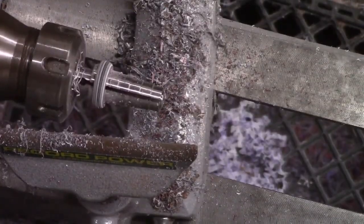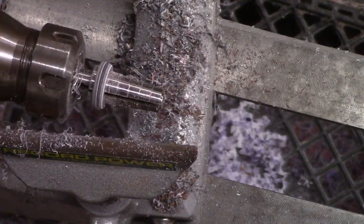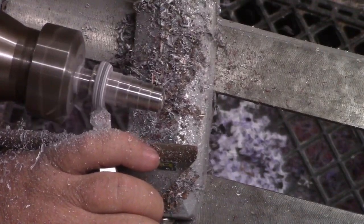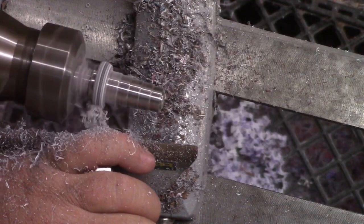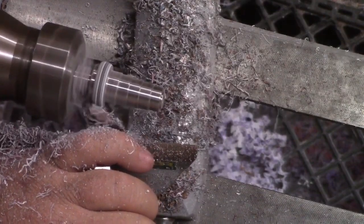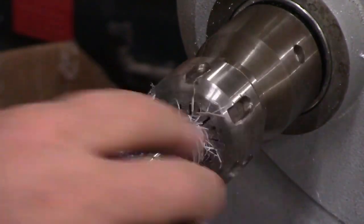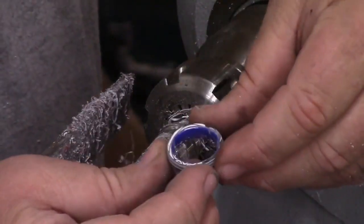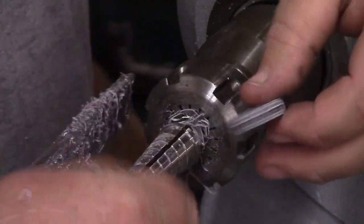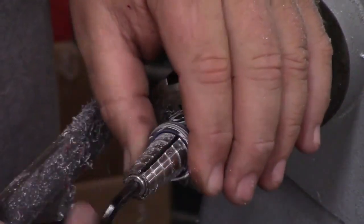There are two sides to the ring: one side has this wavy action which looks like it's moving when you turn it, and the other side has the spots where the paint layers are cut — that's the more fun side. I'm now using the negative rake on a finisher mini tool, just using it to flatten the top of the ring smooth, then inspecting to make sure there are no chips or tool marks before final finishing. This one is looking pretty awesome.